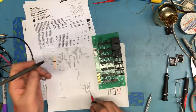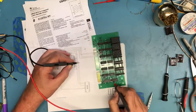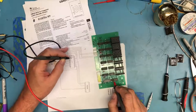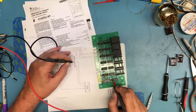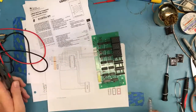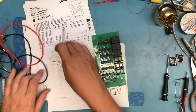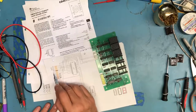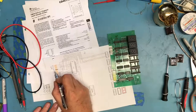So let's go back to pin 3 here, which is A2. We said A2 is connected to pin 15 here. 11, 12, 13, 14, 15. And then we said that's 15 and 16. Well, I'm going to trust what I drew over here was correct. So A2 goes to 15, 16 wraps around to A2 there. So we know that the three address inputs to the demultiplexer are labeled there A0, A1, and A2. So we still have the question of what this undefined input here is.